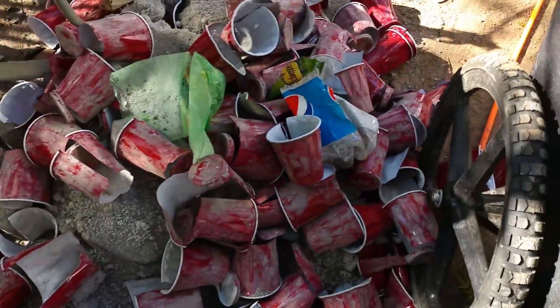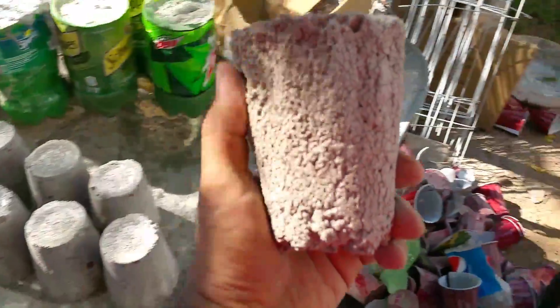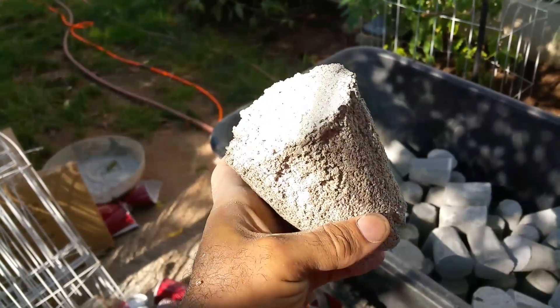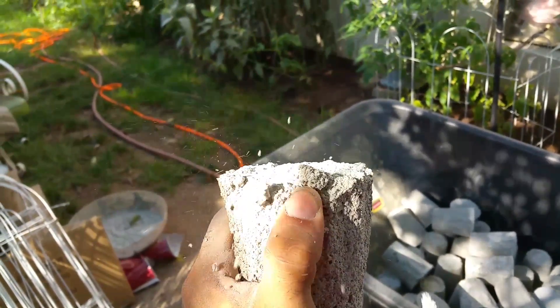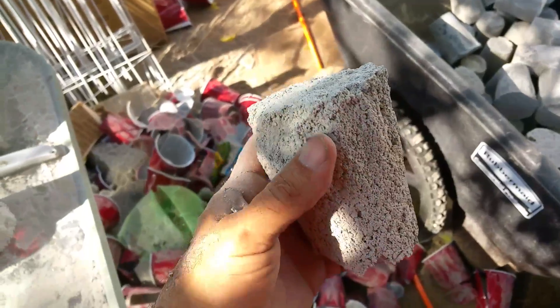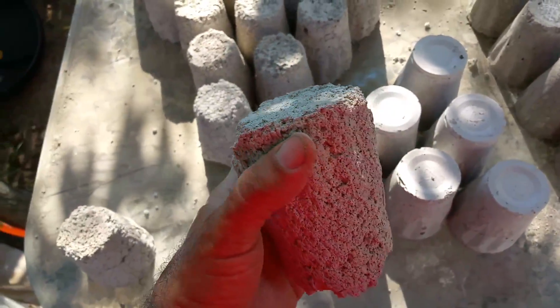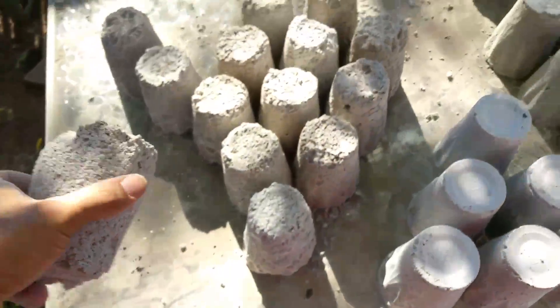After I blended it well I poured it into these plastic cups that I was using as molds, and this is the result I got from the air crete. It's basically brittle — it's only been about four days curing, but either way I've seen these results before. I was also testing out the helix micro rebar in this, and it clearly doesn't do anything with air crete this porous.